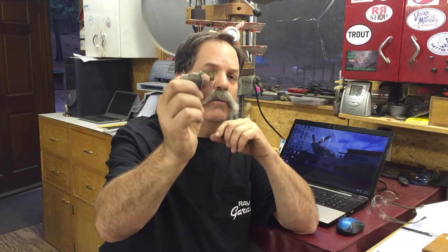We want to make a 45-degree milling chamfering tool with a square insert. This one has straight sides on it — no relief angle. But the one we were going to use has, I think, an 11-degree relief angle on it, which makes it a little easier to mill. With this one, we'd have to set it so they have some negative rake, which is a little more of a challenge.